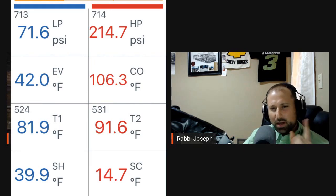I went ahead and cleaned the coil before I stuck all my probes in the airflow field piece stuff I had on it. Cleaned the coil, fired it back up. Head pressure was a lot lower. But the one thing that stood out to me was I had like an 81-degree suction line temperature.